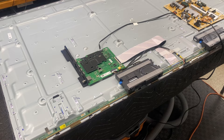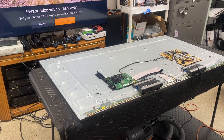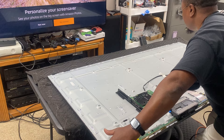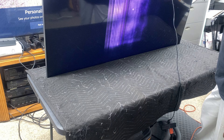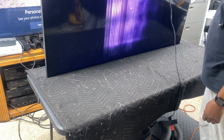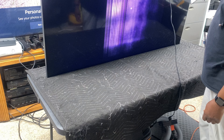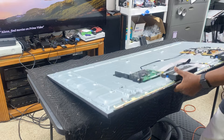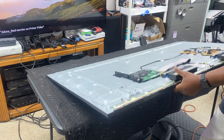We're going to see what this picture looks like. Yes - I put a piece of tape on the ribbon cable. It came on - it did come on, look at that! I know you think I'm magic, sometimes I think I'm magic. That's the craziest thing, but believe it or not, it works. I chose the right pin - I didn't count them or anything, I just saw the black scarring. The picture is ugly, and the reason why it looks like this is because we have a very bad panel. This TV is not repairable. If you have the same problem, your TV is not repairable.